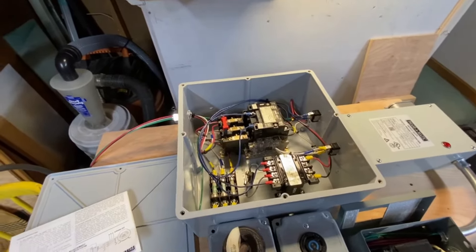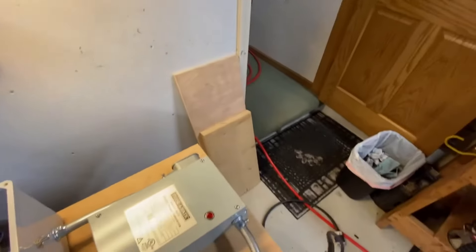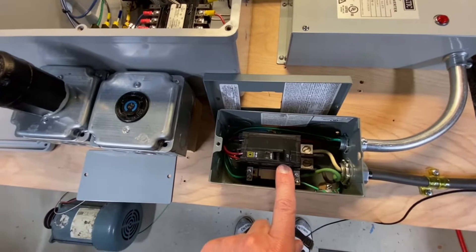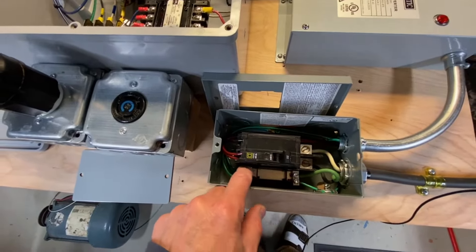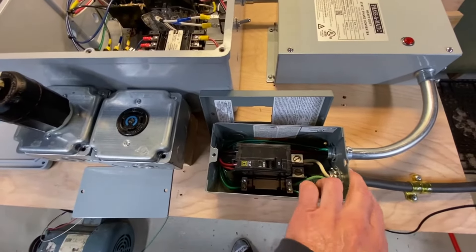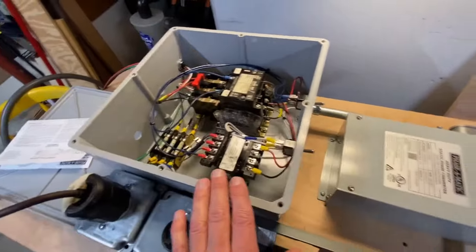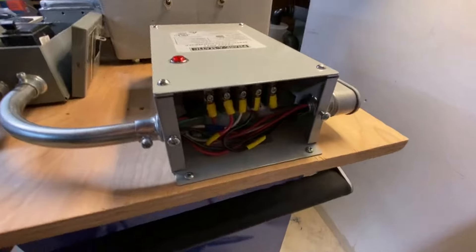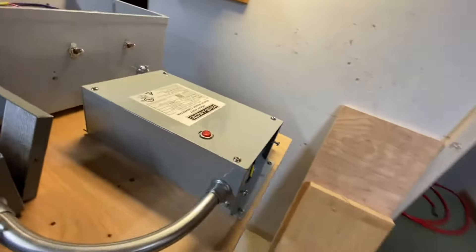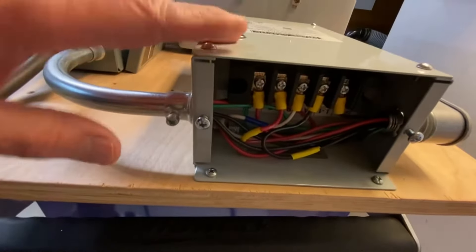It might be useful to walk through how the power flows through this thing. Over on the wall I have a 220 20-amp twist lock where power comes in through that plug, through a simple two-pole 20-amp breaker. I repurposed the common bus as a little ground bus, which served me well to run ground wires throughout. Power comes in on the SO cable through this breaker and then goes out through this conduit — all the wires actually end up going out that way into the big gray box. I was really thrilled to have the generous amount of space that Phasematic provides in this new version, with all separate terminals so no doubling up.